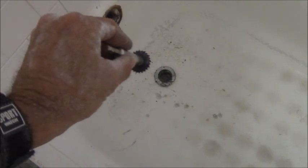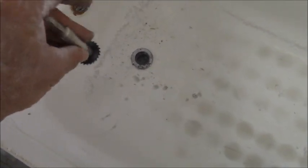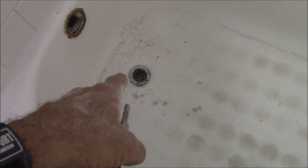And then I did an inside cut on this pipe, you can't see it. Inside pipe cutter, looks like a cowboy spur, goes on a drill. And you go down to where the plastic is in there and you just do a circular type of cut, make sure you get a good bite. That will free up that drain since this top part is broke. This is the only way to kind of get it loose. Otherwise, when you pull up the tub, you're gonna break off all your pipe and have to make a lot of extra repair, which does happen sometimes.